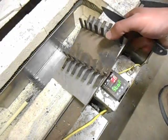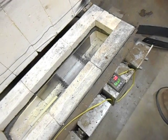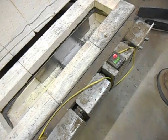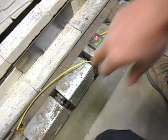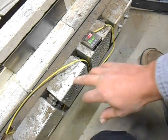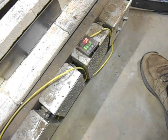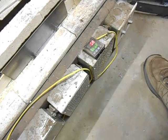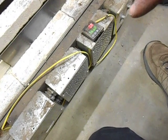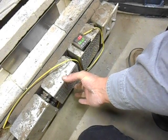And I guess if I haven't made a video yet on my kiln, it was a pretty simple build. I did have to order the PID controller, the SSRs, the fire bricks, pretty much everything but the frame and the electrical outlet boxes that I use just to kind of keep everything together. Yeah, it's worked out pretty good. Occasionally I have to replace a heating element. Occasionally I have to replace an SSR, but I haven't had to replace one of those since I put these covers with the holes on them.